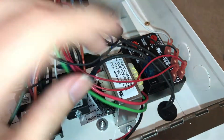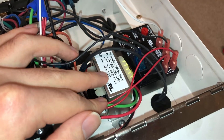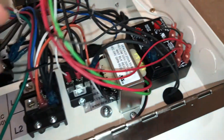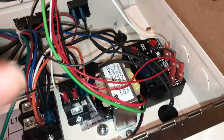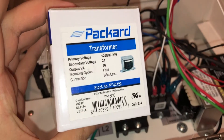To do this modification, the first thing you need is a 24-volt transformer, since you have 240 volts coming in and need 24 volts going down to the thermostat. I just bought a small one — this is a 20 VA unit. It does three different voltages: 120 using black and white, 208 using red and white, and 240 using orange and white. I added some terminal connections and plugged it into the terminal block for the 240, so 240 goes in and 24-volt output is on the red and green wires. You'll need a 240-to-24-volt transformer; I just bought this one online and it fits in there nicely.